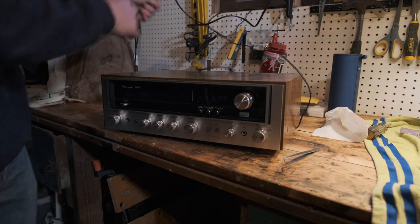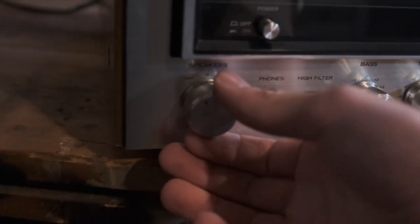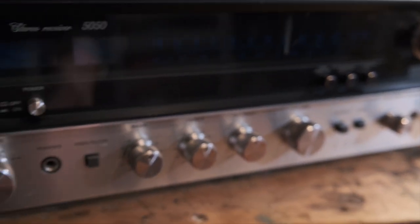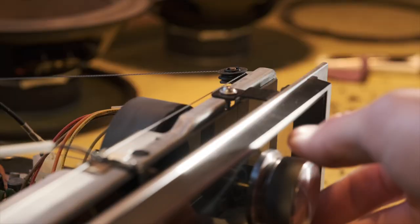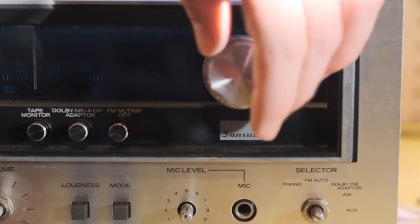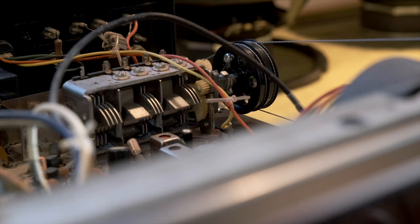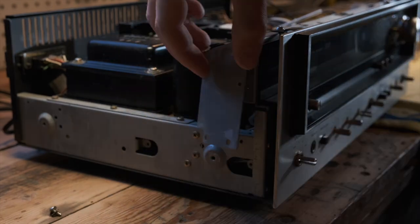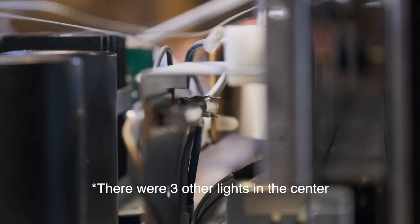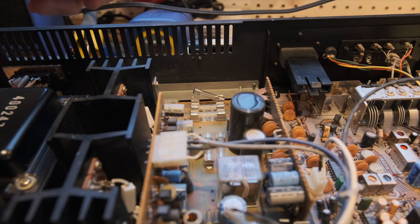I popped over to check out the burnt-out lamps in the receiver. When you turn it on, the lights just don't work — no lights at all. These things look really great inside, so it's always fun taking them apart, especially with the little string that runs the tuner dial. When you move the tuner knob, it moves that indicator light across the tuner face via a system of pulleys to the actual FM tuner — I've always thought that looks super cool. Replacing the lamps usually isn't hard; we just removed a few screws and housings. It turned out there was an issue with the fuse holder running all the lights, and fixing that meant the two bulbs that needed soldering already worked without replacement.